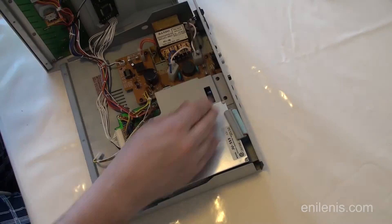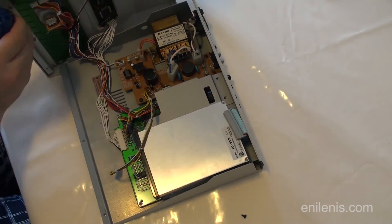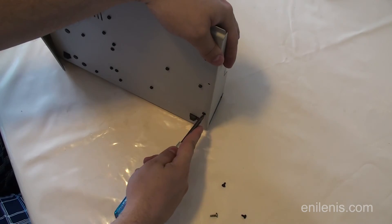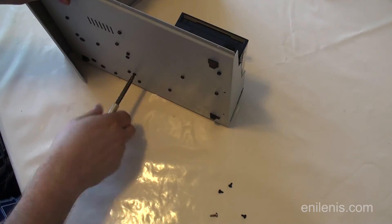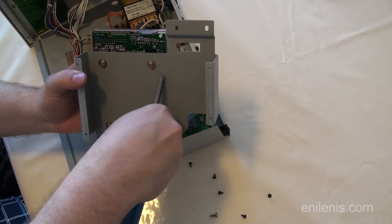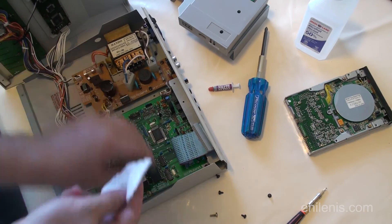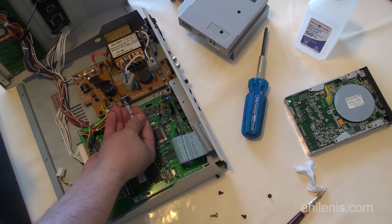Success! All that's left to do now is remove the old drive and insert the new one in its place. The steps are simple, and the only screw you have to be careful about is the one on the left holding the power transistor to the metal frame. The component will have a plastic insulation on it, as well as some thermal paste that will have dried out after 30 years. Pry the component carefully, then proceed to remove the rest of the metal bracket from the sequencer. It should take half the time to put everything back together. Now is also a good time to reapply thermal paste to the insulation pad — remove all residue with rubbing alcohol, and that is it.